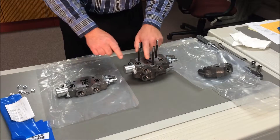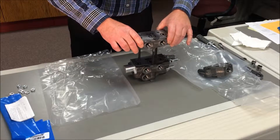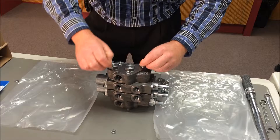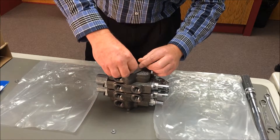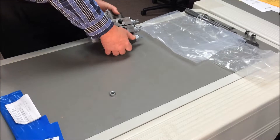After all work sections have been added, slide the inlet or the outlet section over the tie rods with the threaded ports facing up. Place lock washers on the tie rods, then lightly snug the nuts by hand.